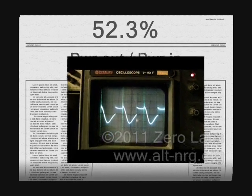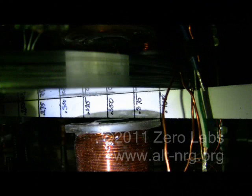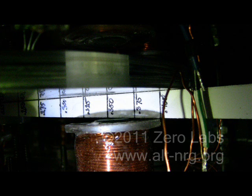I know for a fact that my stator pole gap around the rotor varies as much as 12 thousandths of an inch plus or minus. The need to be able to independently adjust each stator pole to very tight tolerance is becoming very evident. One more thing is now also very clear: I am knocking at the door, and that door will be opened.